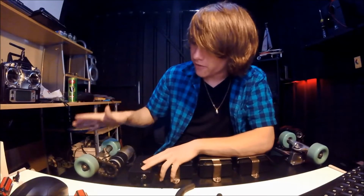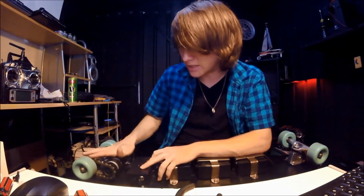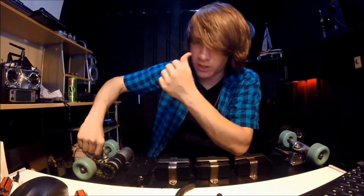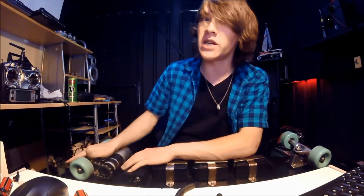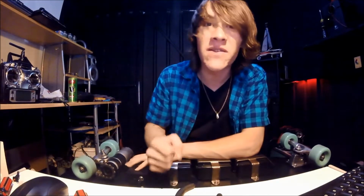It used to be 15 amp, 50 volt rated wire, and it melted. This motor draws so much current, it melted the wire, and that did not end well, actually. It really did not end well. I burnt out a receiver. I have never burnt out a receiver in my life until this project. I've burnt out 6 receivers on this project. 6! 2 of those cost $70.